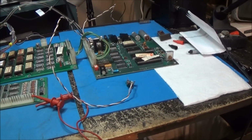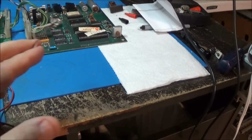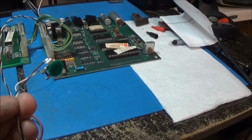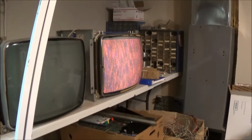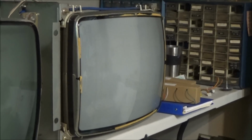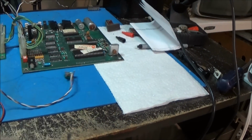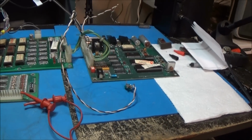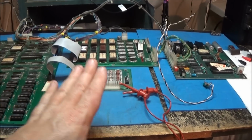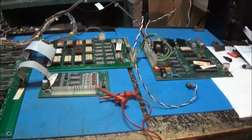Alright, I don't know if I read the schematic wrong, but I actually looked it up online and it said 50K pot for the volume. I just soldered in a 500K pot right here, and I'll go ahead and reset it. The sound is much more manageable. Yeah, it's a 500K pot. Cool, this thing's working good. So I'm going to print off my pinouts so that I can poke around, start a game, coin it up and all that. So I'll be right back.